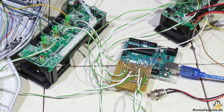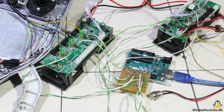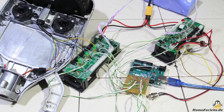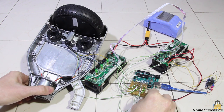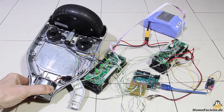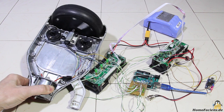As soon as the Arduino Uno is connected to the control pins of all three half bridges, we can take over the motor control. Six control pins and three sensor pins are required for each motor. Since the driver chips of the half bridges work with an input voltage of 12V, they will most likely tolerate a logic voltage of 5V, compatible with the Arduino Uno. If you want to go the safe way, you can reduce the 5V of the Arduino Uno via voltage dividers to 3.3V, as I have done here.